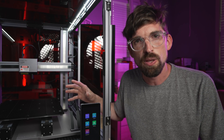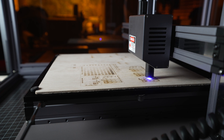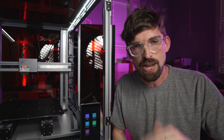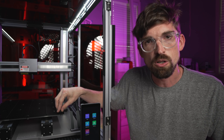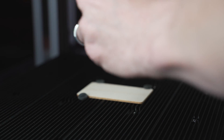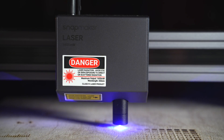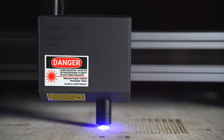My main drawback with this machine for laser engraving is that the work bed moves. Most of the time with laser diode machines you don't need to secure your material, but here, because the bed is moving, it's going to introduce movement and you'll need to clamp things down. The provided rubber holders kind of work, but for thicker material you'll want a proper clamping solution. The moving bed can also introduce some vibration when engraving, though in the few tests I did at the speeds you'd realistically run this, it's really not noticeable.